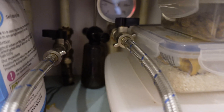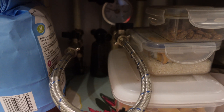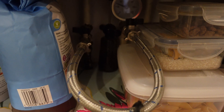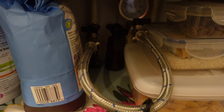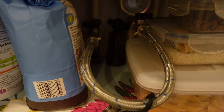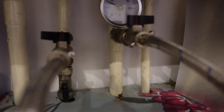I just happened to catch it by luck before it hit 3 bar. One thing you don't want is for the PRV — the pressure relief valve — to blow off. It protects the boiler from too much pressure. Normally PRVs do reseat, but sometimes they don't. You may find that once the PRV has blown, it doesn't reseat back down and you just keep losing pressure and have to have it renewed — a bit of a nuisance.